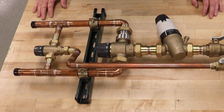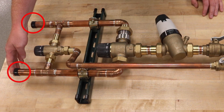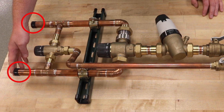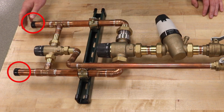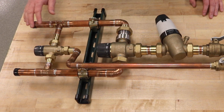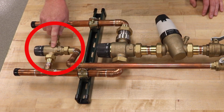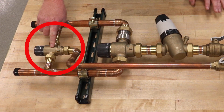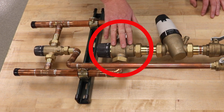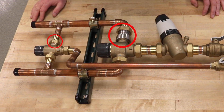Starting at one end of the assembly, you're going to have your cold inlet as well as your hot inlet from your hot water source. These are one-inch connections that you can easily press a fitting to or sweat a fitting to. Next, you're going to have your thermostatic mixing valves — a 521 series, which is the small mixing valve for lower flows, and a 5231 series for higher flows. On each of the cold inlets, you'll have a check valve to prevent thermal siphoning and migration of heat.